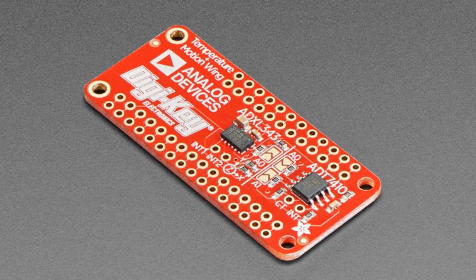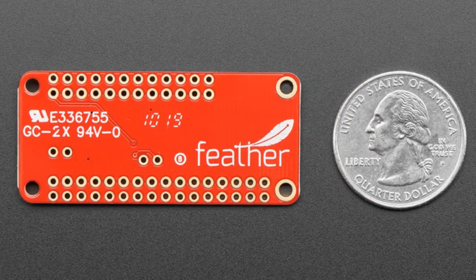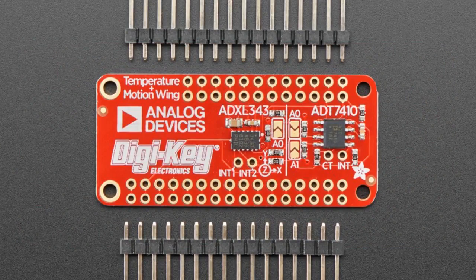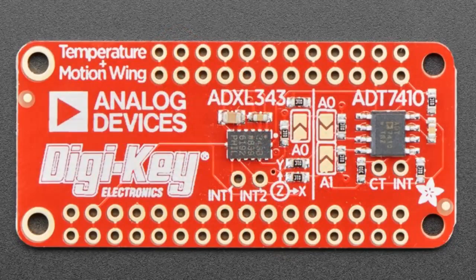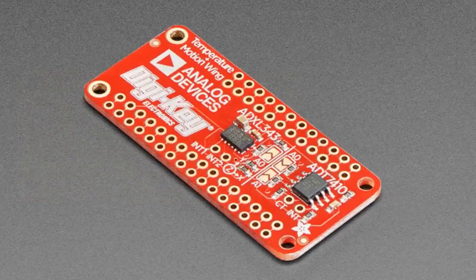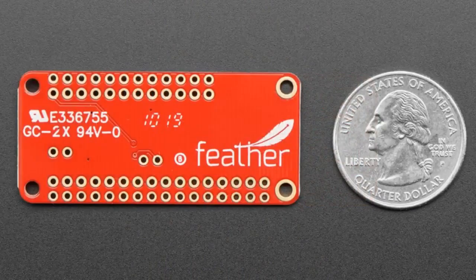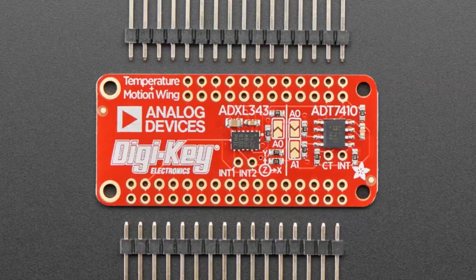The star of the show is the Featherwing — we finally have it ready for the store. It's the Analog Devices and DigiKey Featherwing, our first sensor Featherwing. It works with any Feather you have, even ones that don't exist yet, because it only uses the I2C pins. It features the ADT7410 Precision I2C Temperature Sensor and the ADXL343 Triple Axis Accelerometer. The accelerometer is placed in the center and the temperature sensor off to the right, away from the power supply to avoid heat interference. It comes in DigiKey Red, sponsored by DigiKey. We've got code in Arduino and a CircuitPython library, so no matter what you're using, you'll be able to get sensor data into your Feather and out into the world via IoT, data logging, or whatever you need.